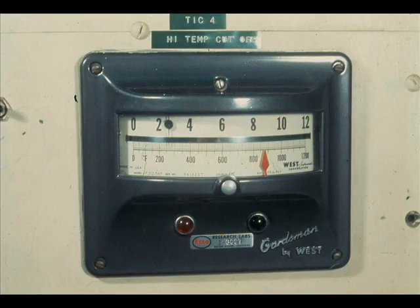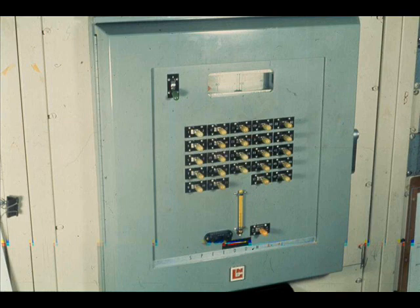The meter scale may look like this one, or the temperature may be recorded on a chart. A meter can have a switching arrangement to permit selecting any one of several thermocouples to measure. In this way, one instrument can be used to measure any one of dozens of temperature points.